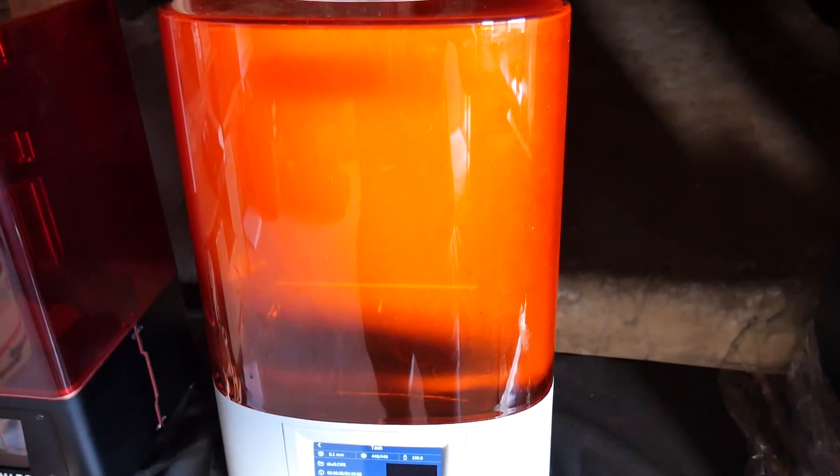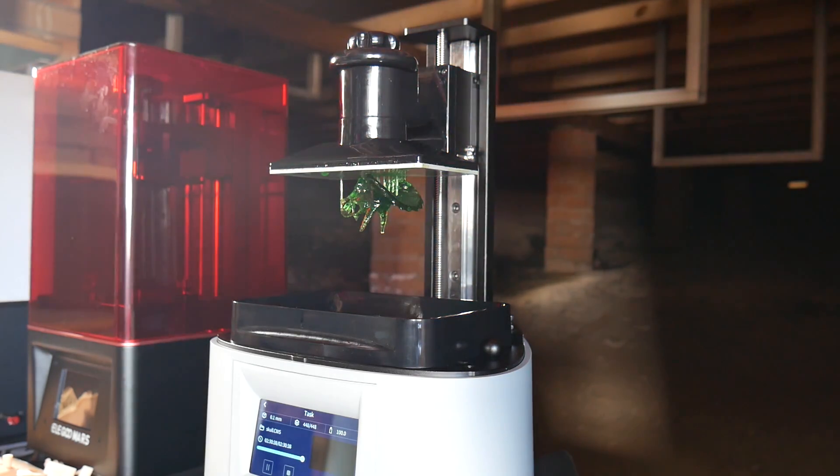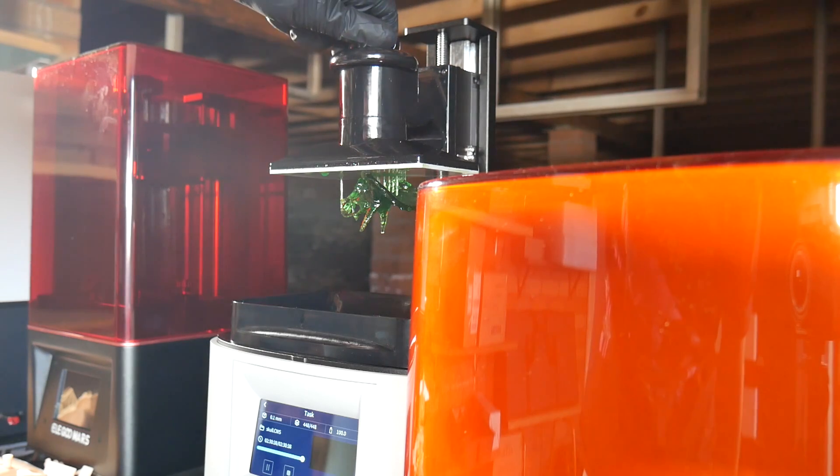I made a video discussing the safety of resin systems, but a quick look at the enclosure after a few runs reveals just why this technology should be taken fairly seriously. It started to fog up — and not just a little, quite a lot. I'm not exactly sure why, whether it's water moisture from the resin or something more volatile, but that's definitely something to keep in mind and why I run these printers in a dedicated, well-ventilated area.